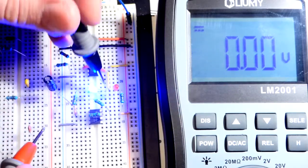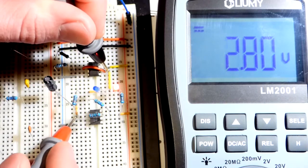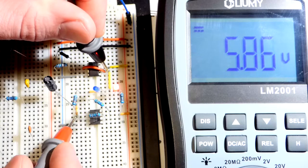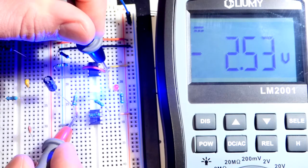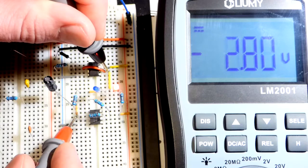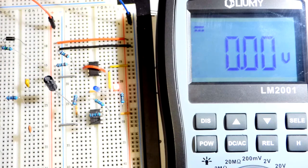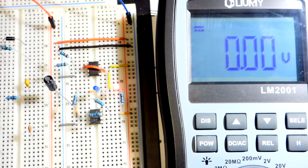I swapped out the auto-ranging meter for one where we manually set a range — it's set to measure 20 volts or less, so it should be more stable. When we get to six and a half we should see the output flip — and it just flipped. Now when it gets to negative seven we should see it flip back — and there it goes. A multimeter is not perfect for measuring changing voltages, but you get a pretty good idea. You just have to take into account how the meter affects the circuit and readings. Hopefully you enjoyed this video — thanks for watching, see you in the next one.